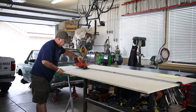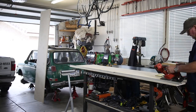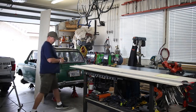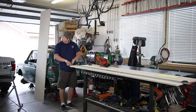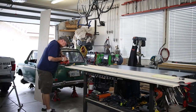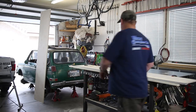So what we're cutting out here are the cabinet sides, the floor, the back, and the front styles. I'm trying to get all the cuts necessary to get these things assembled. I'm going to be assembling these with Titebond 3 Ultimate Wood Glue, which I picked up at Home Depot — I use that all the time, works really well. We're gonna be assembling it with 16-gauge inch-and-a-half finish nails with my nail gun.